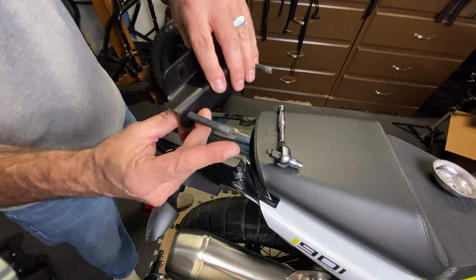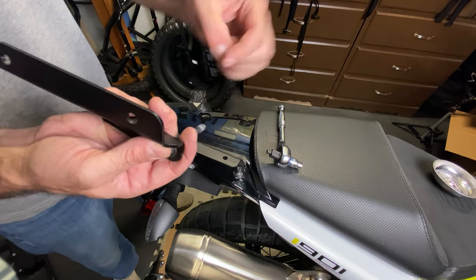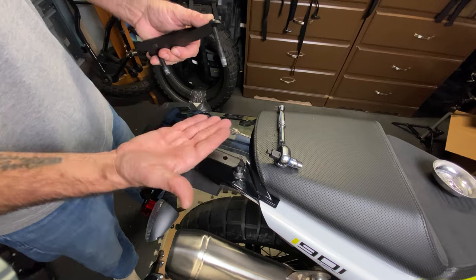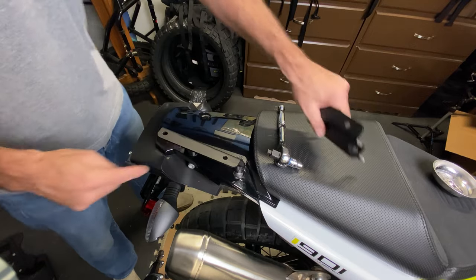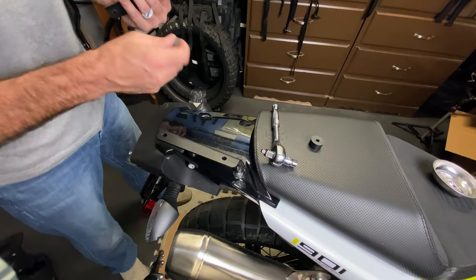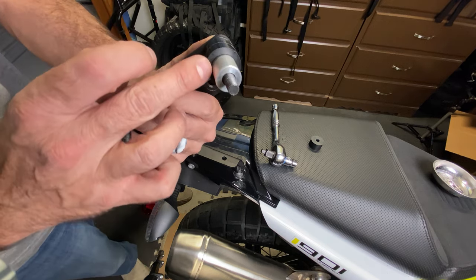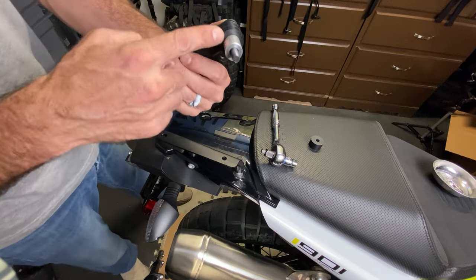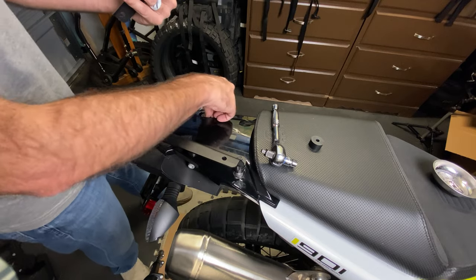One thing to remember is that the depth of the hole where it screws down into is only so deep, so you have to have enough spacers so the bolt doesn't bottom out. I wanted it to sit a little bit lower than it would have on top of the handles, so I did that equation in my mind and figured out how many spacers to use. Also, the outside diameter of the spacer I bought was too big — the recess wasn't going to accommodate it — so I took a Dremel to it. It's not pretty, but it'll sit down in the recess and I won't see it anyway.